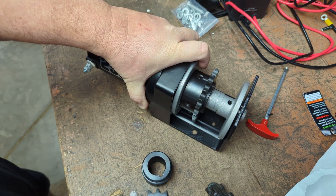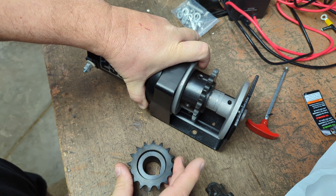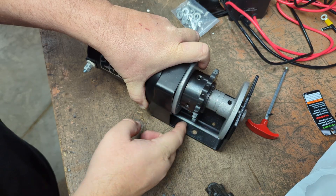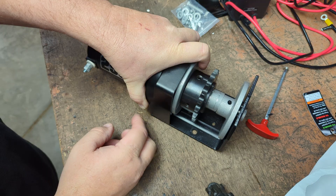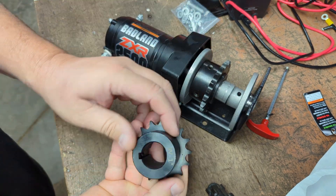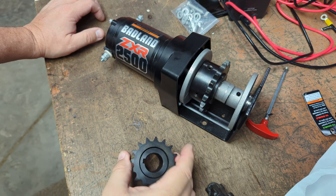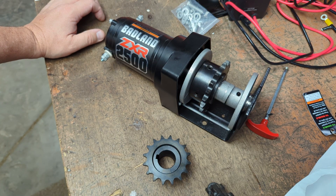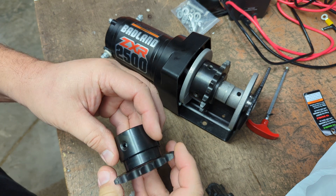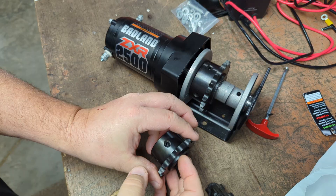The sprocket will be in the middle. This is the best gear ratio I could get — the biggest one up there and the smallest one I could find for the trailer handle shaft. I had to stop there because the chain's got to clear and fit through here, so that's about as big as I could have gone. This is 20 teeth, this is 16 teeth, so it'll be a little better than one-to-one — one turn around on this will be 1.25 turns on the jack handle. That's the best we could do; the parts available at Rural King were these, so that's what we're going with.